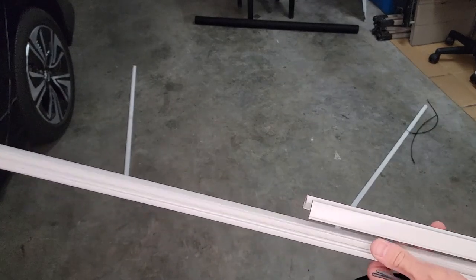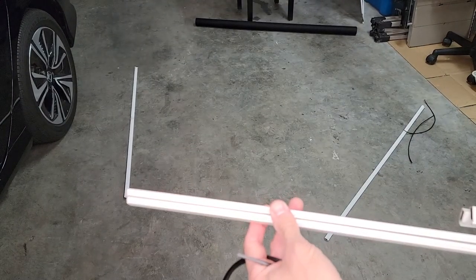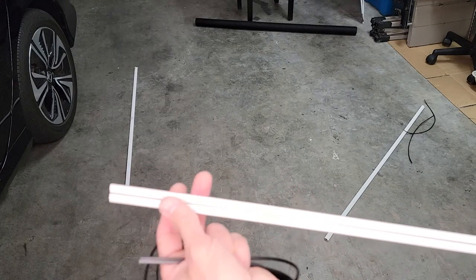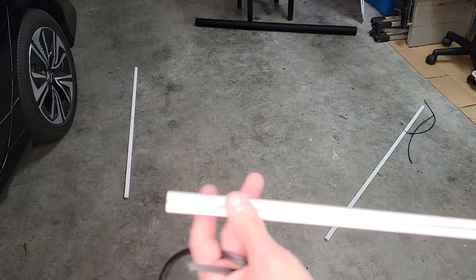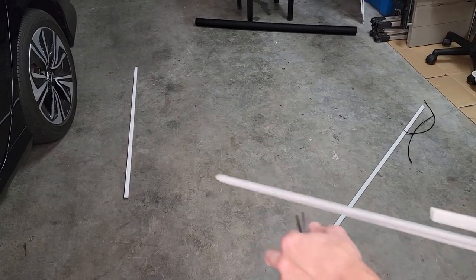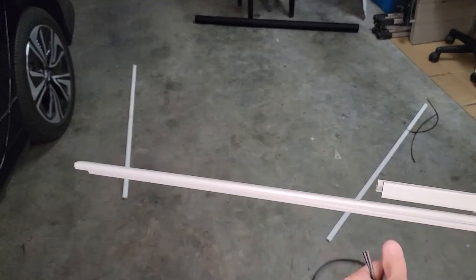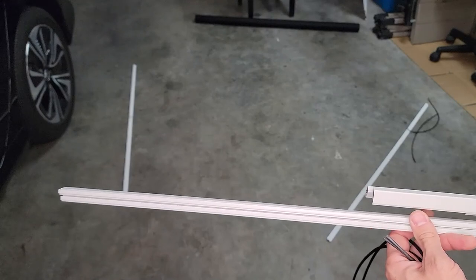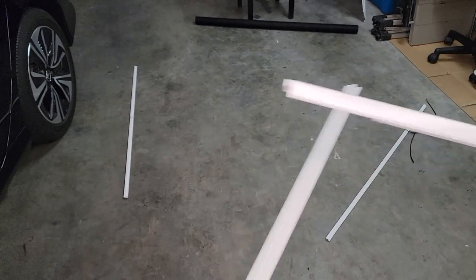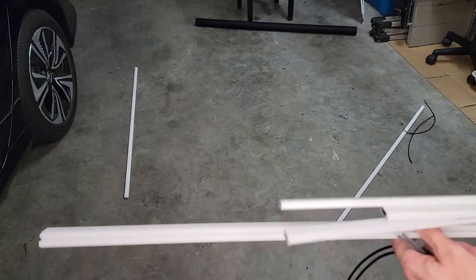I can do this. To cut these the same length, I'm doing two windows at a time. So I wrapped all four of these up with painter's tape, made sure the ends were level. And then I put my old one across the top, and painter's taped that one together with it, just wrapped it around. Got my hacksaw and just cut evenly, right through all of them at the end. So that gave me the lengths I needed. And we're going to go from there, guys.